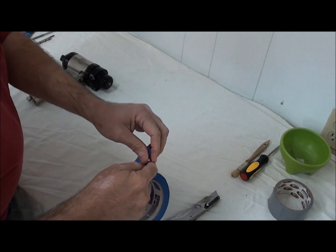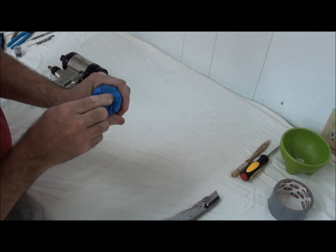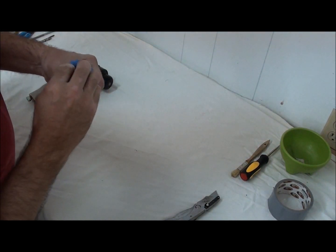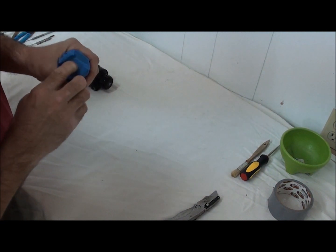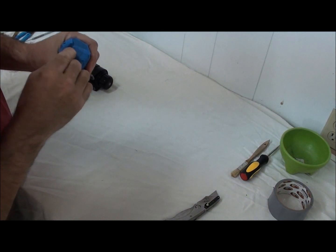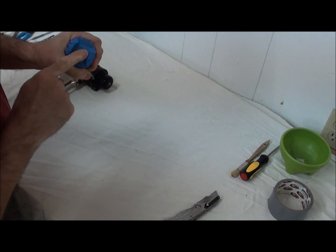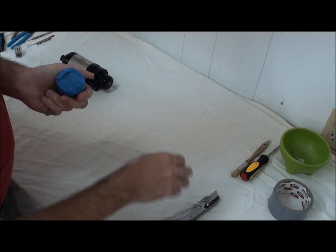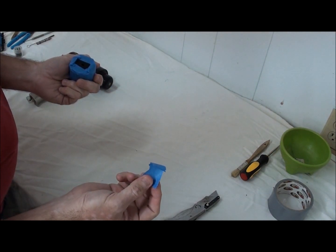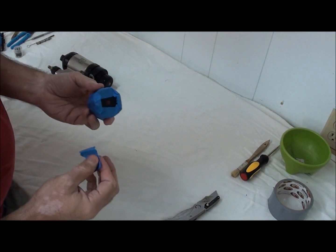So now we have this front face still exposed. Very simple: take a small strip and cover that front face. This area is one of the worst areas to get filled with overspray. As the polyurea material exits the gun, it starts building up on the front face, and this way the dried polyurea doesn't stick to the surface, it just comes right off with the masking tape. And if I need to, I can just peel this front face off and replace it with a fresh piece, so I'm not having to rewrap the entire air cap.